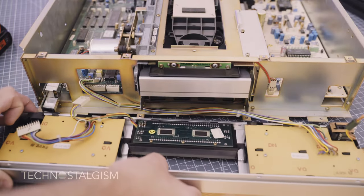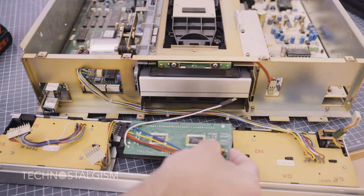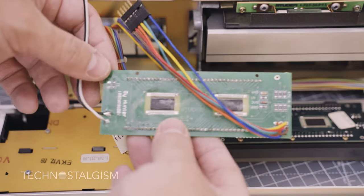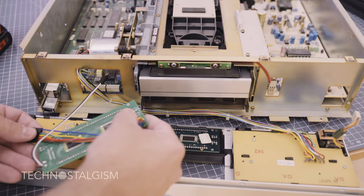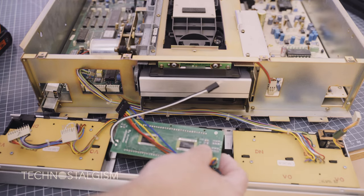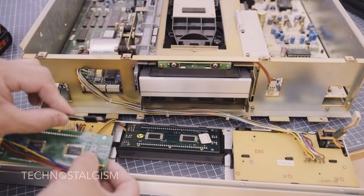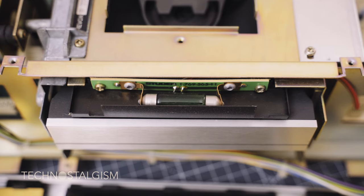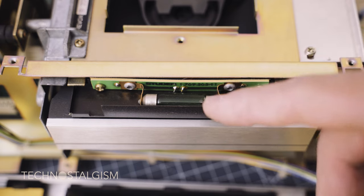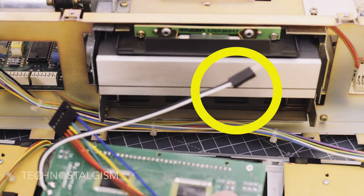Removing the original display is only a matter of removing three screws and lifting the board up. The new display seems like it would fit right in. However, there are two wires with pins at the end, while the original display has only one. The replacement part had absolutely no instructions, so let's figure this out. One of the wires has the exact same pin layout as the original display. Since the original display has no backlight, it's illuminated by an incandescent bulb — and interestingly the actual bulb is painted green. So the connector for the bulb will probably supply our LED backlight via the two-wire connector on the new display board.